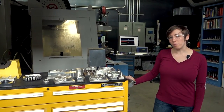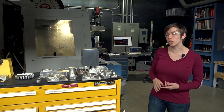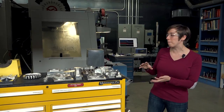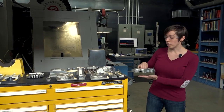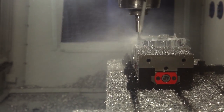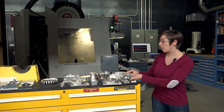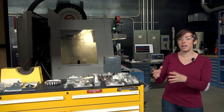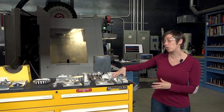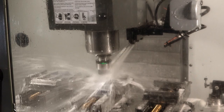One of the most commonly used pieces of equipment in this room is probably this 3-axis mill. It's a Haas 3-axis CNC, and it can cut through all sorts of metals, but here we usually use it for aluminum and steel. The way a mill works is a lot like the DMS, but this one is usually used for smaller pieces and with harder steels. You can cut things with your spinning tool that can go in XYZ profiles and cut through pockets. We've got a table full of examples made on this machine — steel, aluminum — and for a CNC you might make your final item, or also make a tool needed to make another object, like injection molds or fixtures for part flips.